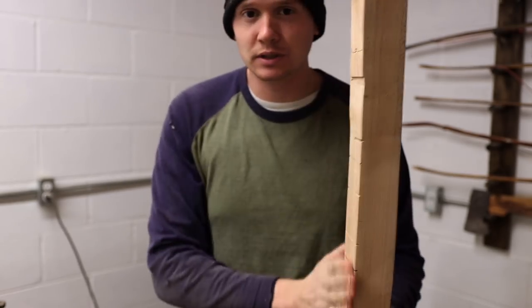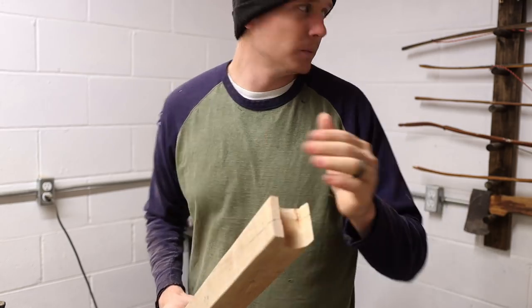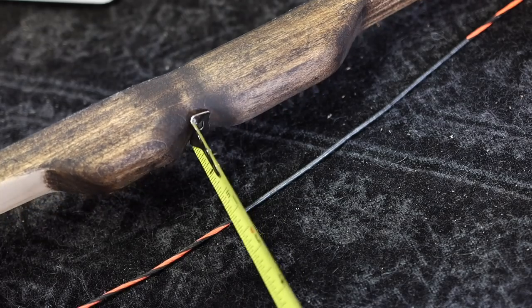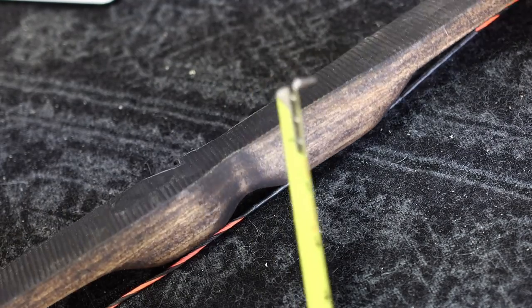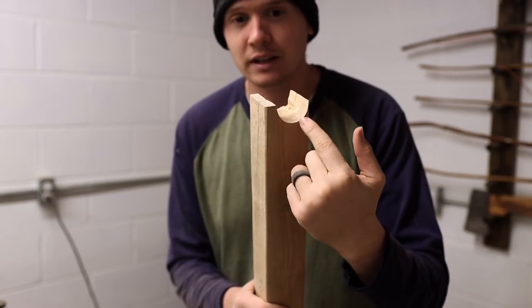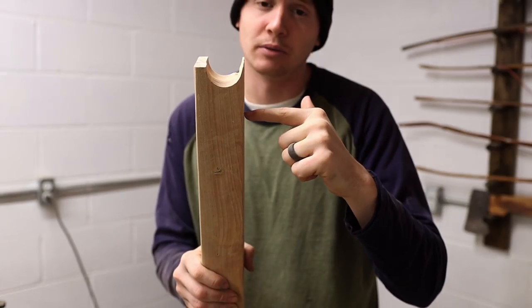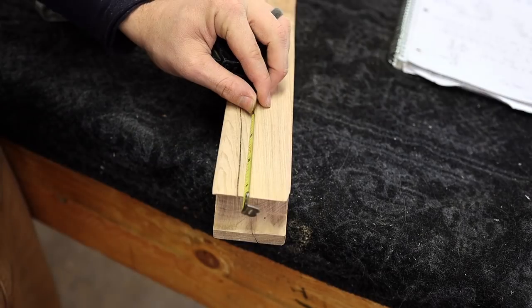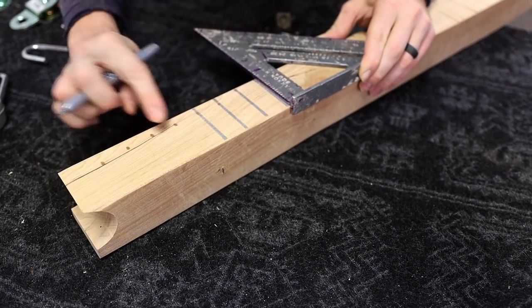We got the top cut in, I thinned out the side where all the notches were so I'll recut the notches. Where do you cut the notches? You've got to measure the draw length, and draw length for most people is measured from the back of the bow. Some people measure from the inside of the handle, but I think it's more universal and consistent to measure from the back of the bow since the depth of the inside of your handle could vary. Average is about an inch and a half from the depth of your handle to the back of the bow. So I'll measure from the bottom of the U-shape up an inch and a half, and from there mark out all my draw length markings.